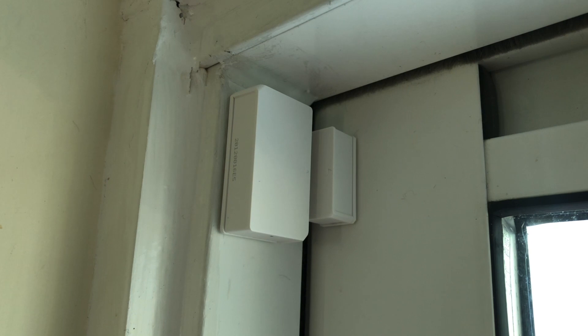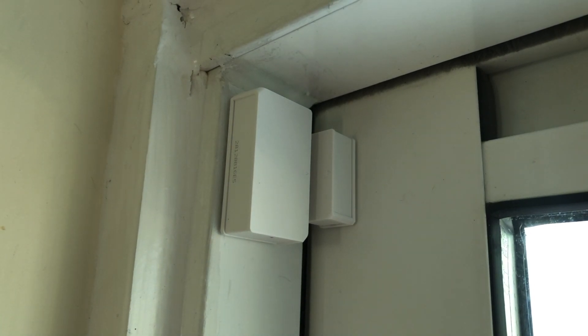You have your sensor all up and running, but there's a final piece to the puzzle. You don't want to be alerted every time anyone walks through that door. In my scenario, I only want this to alert me if the door is shut, because I need to open it — no point getting alerted if it's already open. I fitted a little Sonoff Zigbee door sensor to the sliding door and combined that with an automation in Home Assistant. The automation is basically exactly the same as the one from my original Let the Dog Out video, so I'll point you to that video and article for those details. The result is that I can now keep my dining room door shut, stopping heat from escaping through the conservatory's glass roof, but still get alerted whenever the dog needs to be let out.